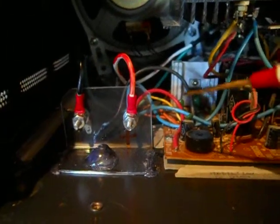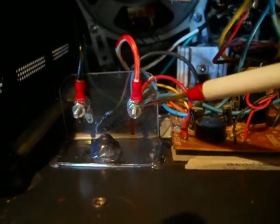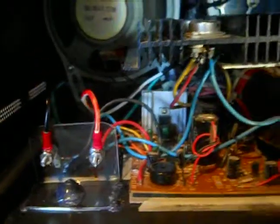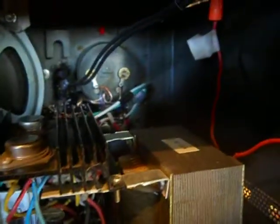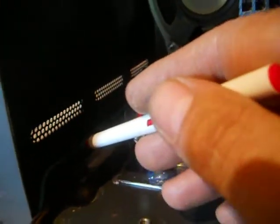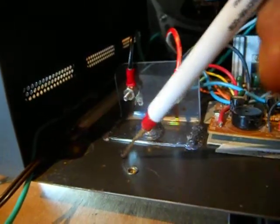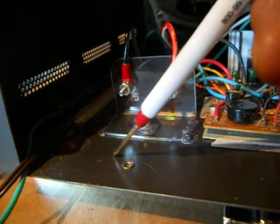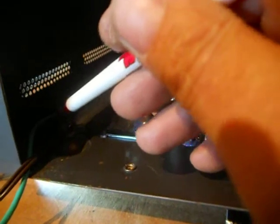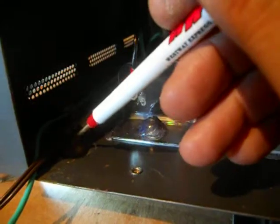I think this is going to be part four. Filming this and doing this can make things complicated. We're getting down to where all we have left is the AC line coming in. I have a spare terminal on the far right — a hole. I put a ground there. It will be an antenna ground; it will not be hooked to this cabinet in any way. It's a separate ground to ground my antennas and anything I hook up, so it's a convenient ground when I'm working on something.